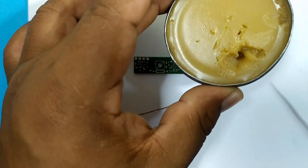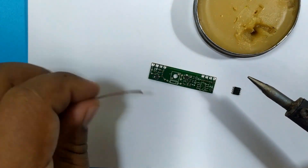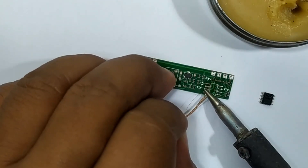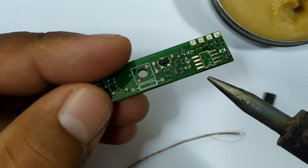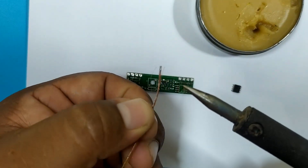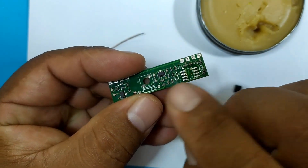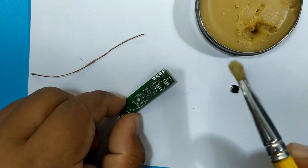We are also going to use a soldering paste to help remove all the tin. We use our soldering iron — put a little paste, and with the help of the soldering iron we press to remove the excess tin. There you can see the difference: there is no excess tin on the cleaned area, but there is still some on the other. All the tin sticks to the wire with the help of the paste. We do the same with the other group of pins. Now we have it completely clean. Now we have to clean all of this with a little alcohol, and with the help of a brush we remove all the grease from the paste.